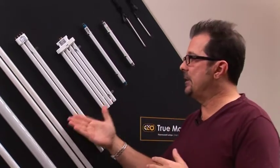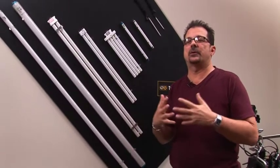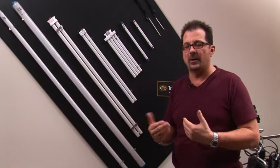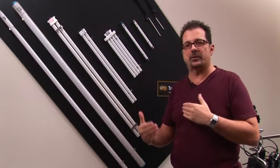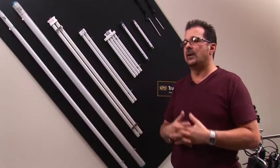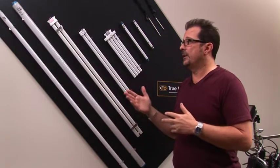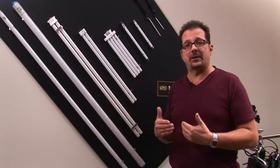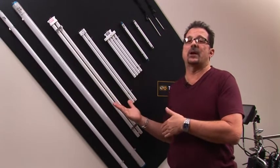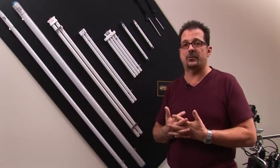The reason we have many lamps in 2900 Kelvin versus 3200 is based on field feedback. The 3200 Kelvin lamps were not warm enough. We found that other systems in the field like ARRI or Mole burn into the 2600-2800 Kelvin range, and the 3200 Kelvin lamps had to be gelled down too frequently. So we created the 2900 line to integrate better on set with existing instruments.